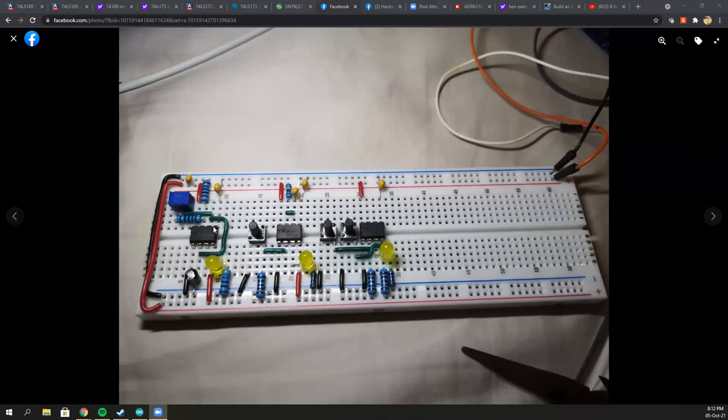What you see in this picture are three ICs — these are the 555 timer chips, each configured in a different mode. From left to right we have the astable mode, the monostable mode, and the bistable mode. The astable mode is used as an automatic timer that makes the LED blink at a regular interval. The monostable configuration allows the user to specify the clock pulse just by pressing a button. Finally, the bistable mode acts as a switch, allowing the user to toggle between automatic pulsing and manual pulsing.